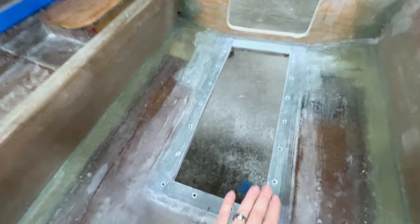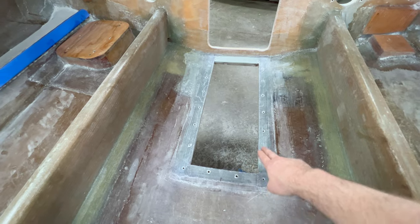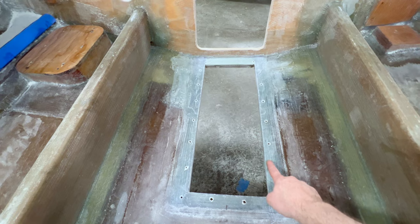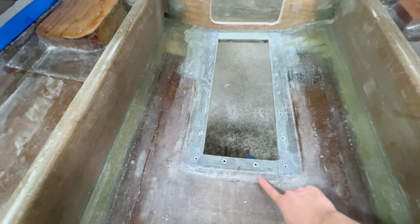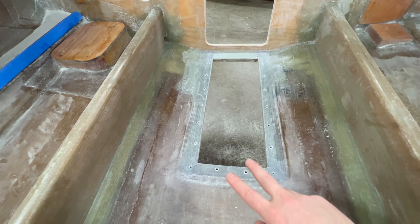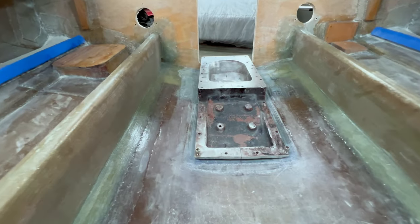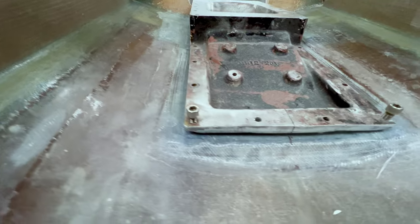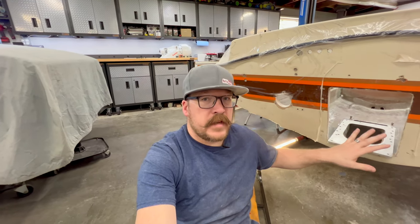It's always great when the end result matches the plan you had in your head. Now that everything's reinforced and built up, you can see I have one level plane where the intake will sit, versus before where it tapered in and followed the shape of the keel. I did this by adding six layers of 1708 on the outside edge — starting with one layer a half-inch wide, then each layer was a quarter-inch wider and layered on top, which leveled them out. Then I built the front and rear up to match and gave it a nice radius. The intake is set back in and leveled, and you can see I have a much more manageable gap all the way around — it's going to be a lot stronger and look a lot nicer.